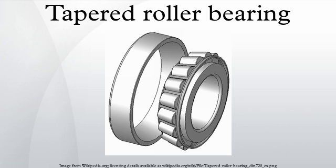When a roller slides rather than rolls, it can generate wear at the roller to race interface — the differences in surface speeds creates a scrubbing action. Wear will degenerate the close tolerances normally held in the bearing and can lead to other problems. Much closer to pure rolling can be achieved in a tapered roller bearing, and this avoids rapid wear.